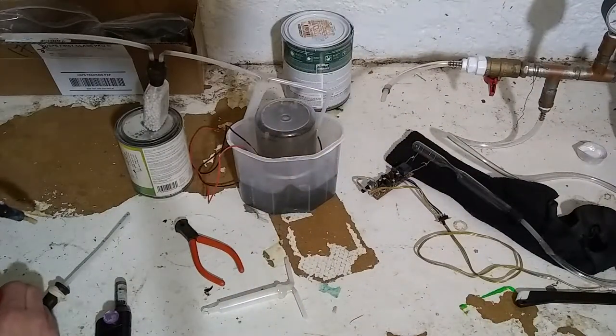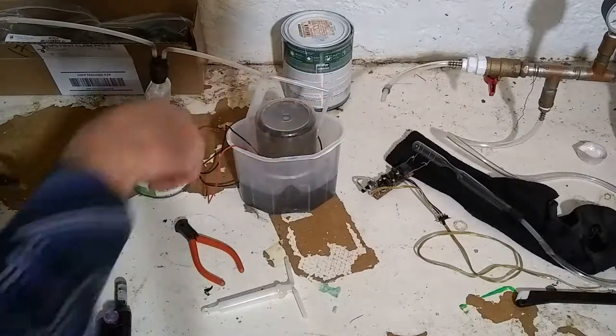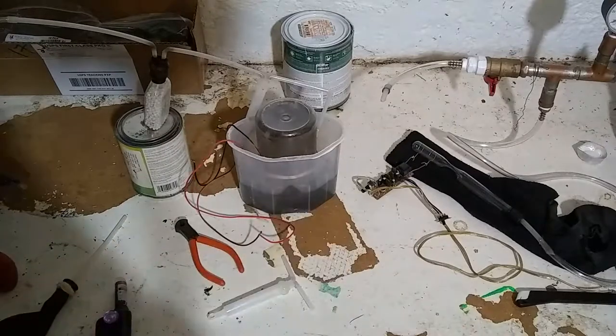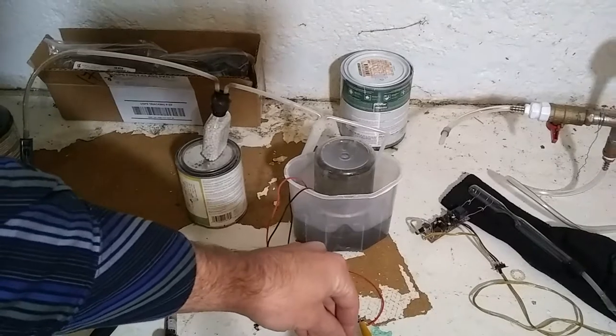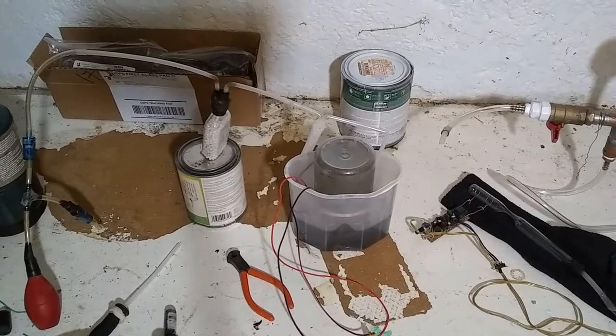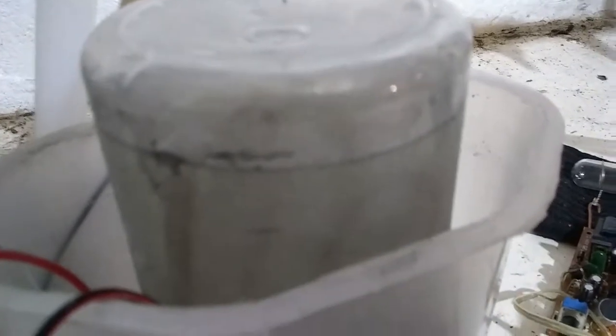Make sure I don't go above the level of the plastic tube. There's still air left in here — I don't want to suck water into the system if I can avoid it. When I connect these two wires that go to the carbon anodes up to the positive side of my power supply, and this is the cathode that I'll connect to the negative side of the supply. Power is connected. You can just barely see the bubbles — those are the bubbles of hydrogen forming. It's a couple of minutes later and some hydrogen has been generated.